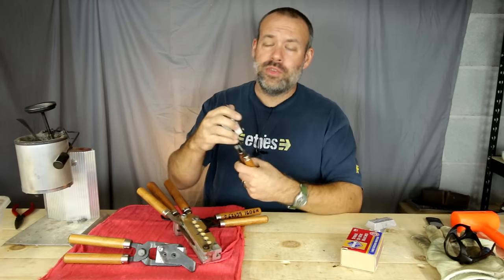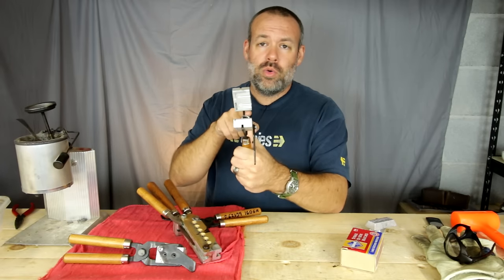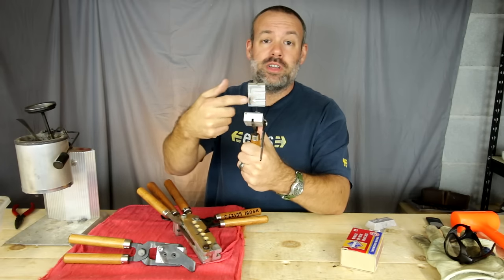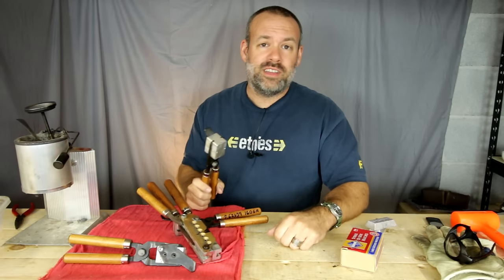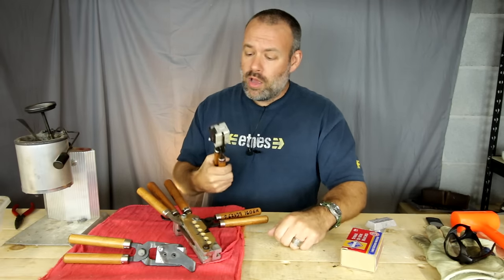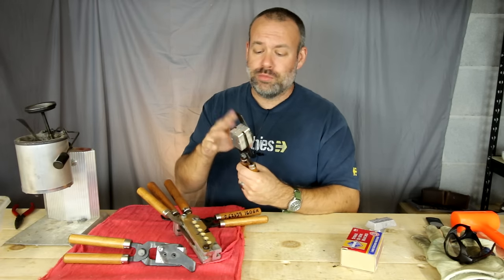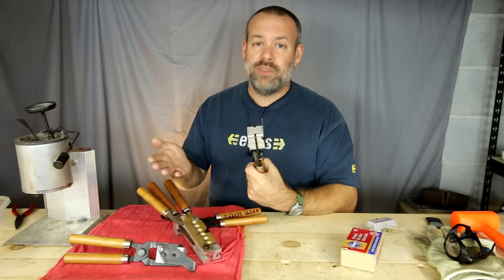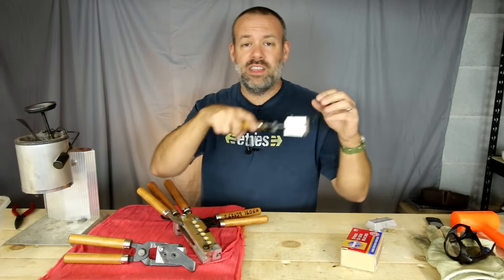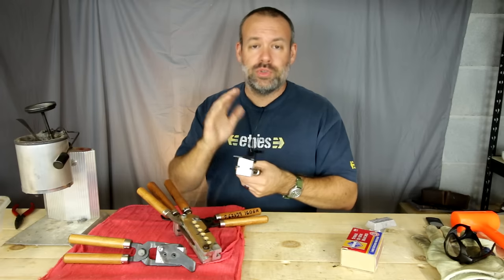This video will be focusing on the Lee Precision made mold, which is basically a block of aluminum with the shape of the bullet you want to cast milled into it. There are several other companies that make bullet molds and they're all fantastic, all made very well. Lee makes them out of aluminum, and I like the aluminum molds better than the steel molds because the aluminum cycles heat in and out very quickly, which means the bullets solidify much quicker than in a steel mold, so your production is much faster.